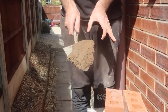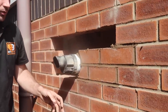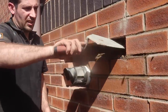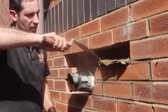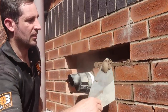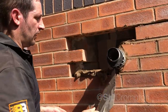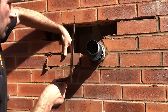Put your mortar on this portion of the trowel, and basically you're just flipping it upside down. It takes a bit of practice, but something like this — like that. And then you can treat it from there. You'll learn a lot about gravity as a bricklayer, because you work with it every day and you don't even notice. Use a jointer, and with it drying so fast, you won't get much time.